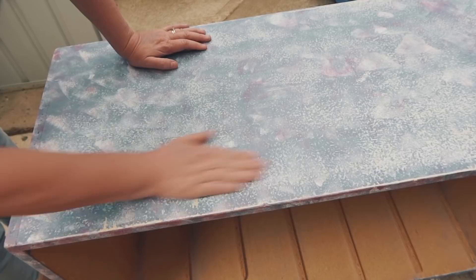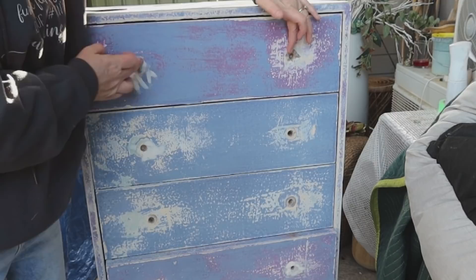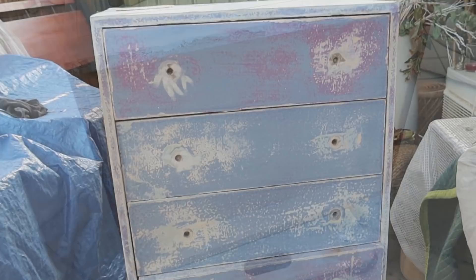Before I paint it, I'm gonna go over it and hand sand it - just like that - with a 240 just to smooth it right off. Change of plan: after I put those in, I don't like the positions and the drawer pull is too far out. So I'm just gonna fill these holes because I don't know what I'm gonna do yet. I'll fill them and decide afterwards - just the usual for me, guys, just making it up as I go along.